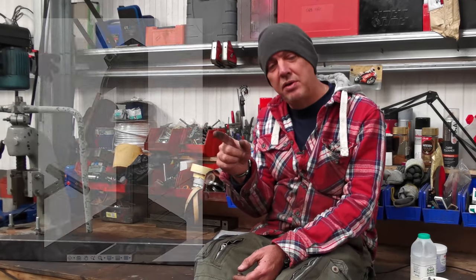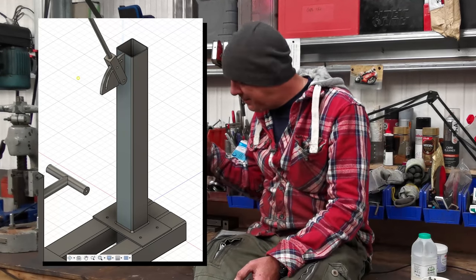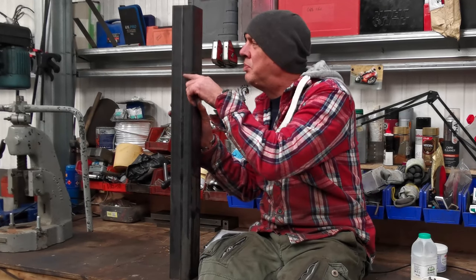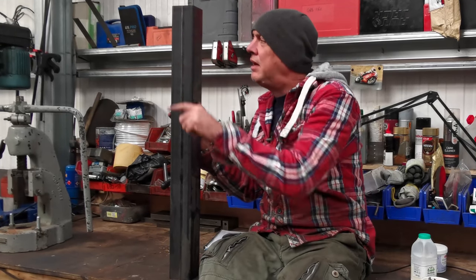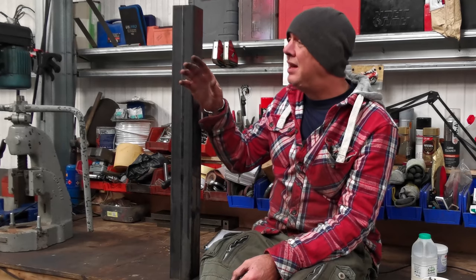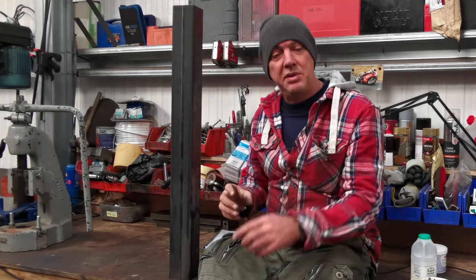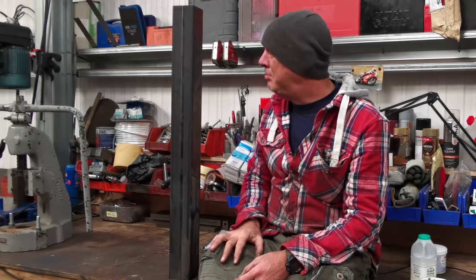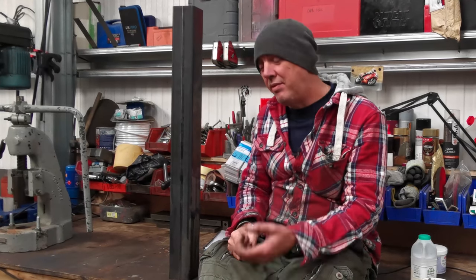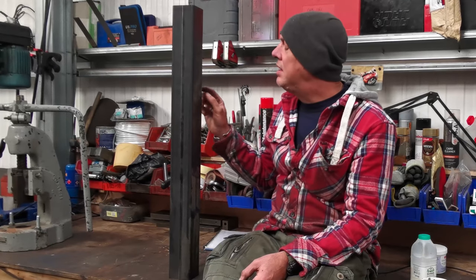So if you look at the headstock, I'm still talking about a couple of ideas on this one. There is probably going to be one of these. What I'm thinking at the minute, anyway, is one of these with basically a quarter circle piece of plate, a hole in here, and I'll slot that so I can put an arm on it, which lets me change the head angle, and then it will just be threaded bar on the end of a boss. So I can have two cones that go into the headstock, and I could set that to any angle that I want, and I'll just mark it up on the thingy: for a Mark 1 Bandit, that's where it's going, and this is the degrees. Something like that, I suppose.